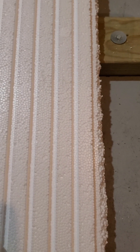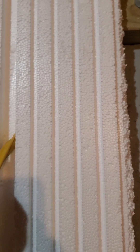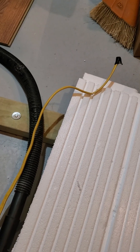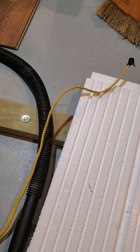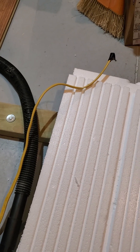It starts hitting the corner and I have a hard time getting it through. It may start gouging into it, so I've never really had much success running wiring in the InSoFast system — either going up the channel or going down here. It's one of the disadvantages of the system. They say you can do it, and if you're a professional you may be able to feel it and prevent the gouging. But when I'm working on a bathroom in my basement and it gouges in, I can't continue to run the wire. But I found a solution that works really well.